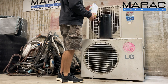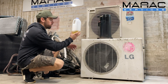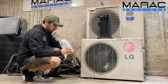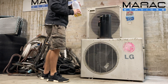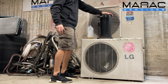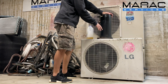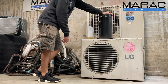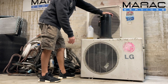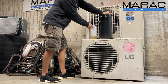I took some oil out of this Copeland scroll that is like 20-plus years old, just to see what the oil looked like. There's slight discoloration but it looks all right. This is the original compressor that runs on mineral oil, it's roughly 20 years old or more, and now it just trips the breaker on startup. The oil part actually doesn't look that bad, to be honest.